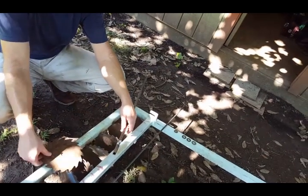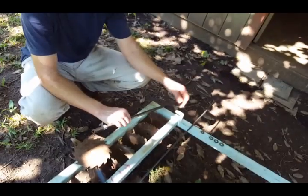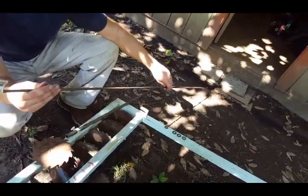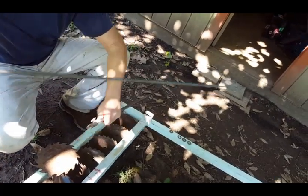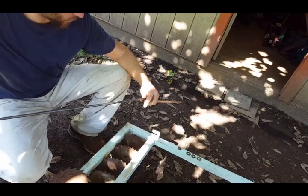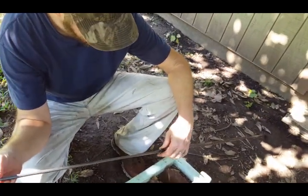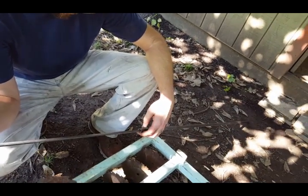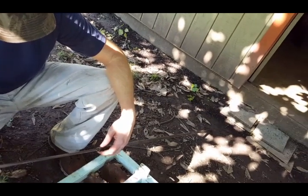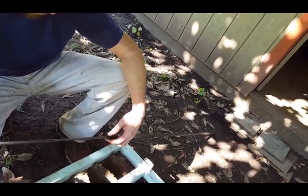So I got this from Tractor Supply, half inch square tubing, very durable. And I got this rod, 5/16 rod. It fits in the square tubing fairly well. There's a little bit of space. But this will spin on top of this, and it might give me enough room to put a grease fitting here so that I can squirt some grease in now and then, and the grease will stay in the corners.